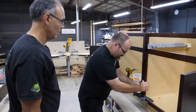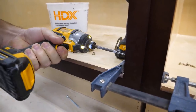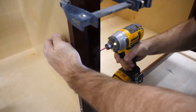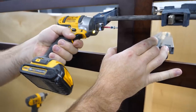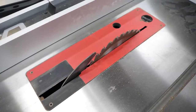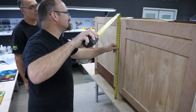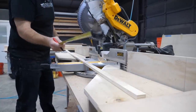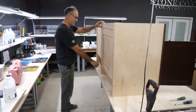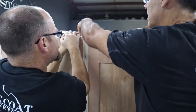By pre-assembling your prefabricated cabinets before you install, we'll create a more professional look and appear like custom cabinets. We're first pre-drilling with a small drill bit, and then we're using coarse thread self-tapping square drive screws. This is a professional application because those screws will hold that face frame super strong. We're going to do the same thing with the back of the cabinet. First, we cut a spacer, then we install that spacer to keep this cabinet square. The spacer allows us to screw through the back of the cabinet through the spacer and makes everything very strong in the back as well, so that when we transport and install, this cabinet is custom made.